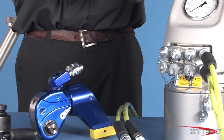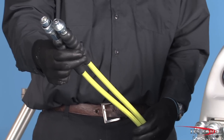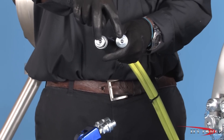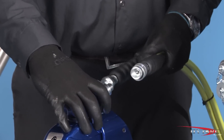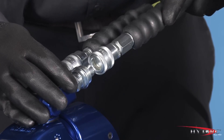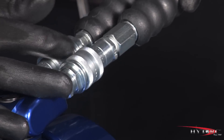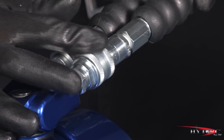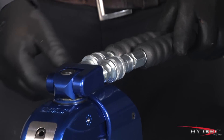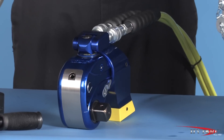The MX-T3 is powered by hydraulic oil from a pressure-regulated pump system connected to the tool by special high-test hoses. Note that both the male and female unions feature a small, spring-loaded check ball which must be fully seated for the oil to pass. Ensure that the hydraulic hoses are firmly screwed to the uniswivel using only finger-tight force. Even the slightest loosening of the threaded connector will shut off the flow of oil, preventing a high-pressure leak that could otherwise be dangerous to the operator. Do not defeat this important safety feature by substituting other connectors that may not be rated for these 10,000 psi pressures.